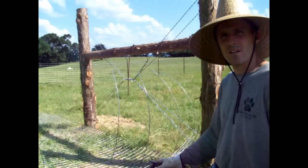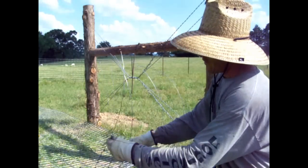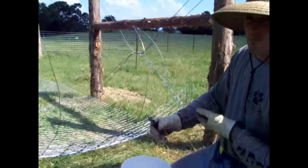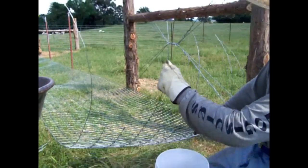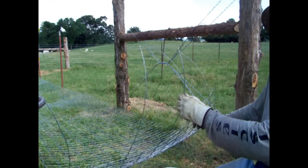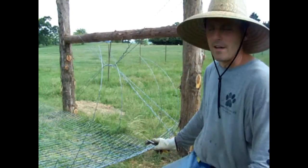We've gone ahead and pulled off all the pieces on the top. For the middle ones — they're tied a little differently but the same principle: take a pair of pliers, spin it a little bit, and simply pull it off. So on the top wire we've taken off two, left one; taken off one, left one; taken off two, left one; taken off two, left one; and then we took off the bottom strand too because it's really hard to tie it down in the dirt and twist it around there. It actually seems to work out real well.